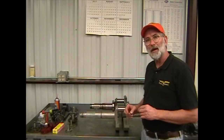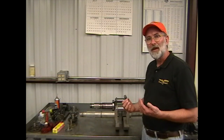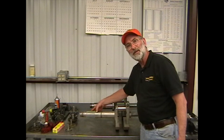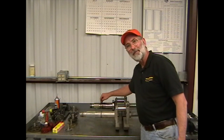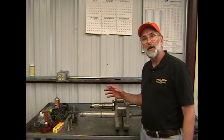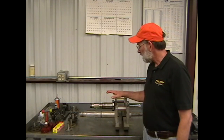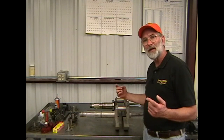That's a quick and dirty way to tell the difference between an aircraft engine and a tank engine, but it's not foolproof. Back in the 1960s, Gulf Coast Dusting did a conversion on the tank crank where they machined the shaft down to aircraft diameter, then tapped and threaded another portion on to make it the same length as an aircraft shaft — allowing an aircraft propeller to be used on the tank engine. This Gulf Coast conversion was used on many crop dusters, early A-model AgCats, and several other dusting and spraying aircraft.